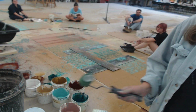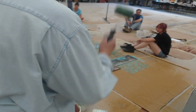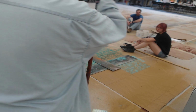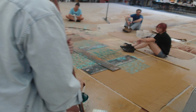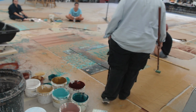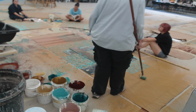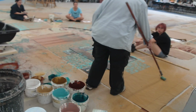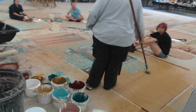So rollers normally are used for just putting your paint on a wall. Know that when you do roll paint on a wall or on a flat surface, you always do a thing that's called back rolling. So when you're using a roller to base with, if you're just using it straight up flat to cover square footage, you always put your paint on and then you come back over and do what's called back rolling over the area that you just painted to smooth it out.